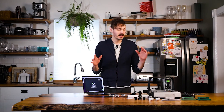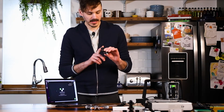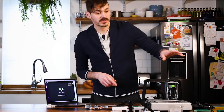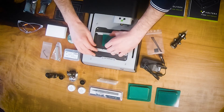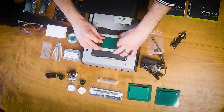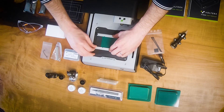I've got the cartridge of conductive ink now in this dispenser sheath. The piston is down on top of it, and I've got a nozzle screwed onto the end so that we can get started. First, we're going to mount the substrate on the bed. I've set down the clamps with the thumb screws here, so just slide that into place and tighten the screws.